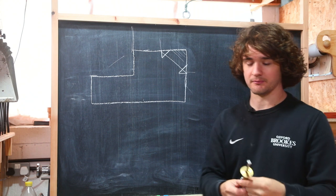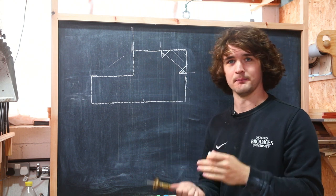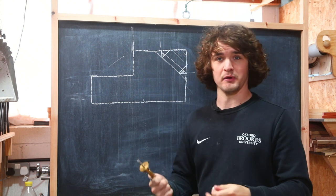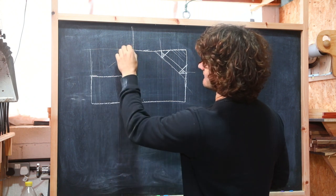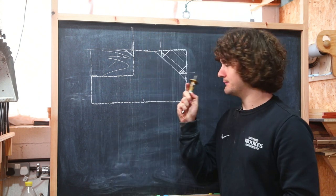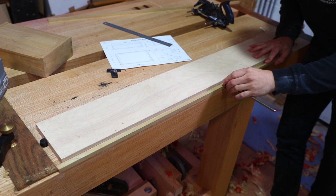Although we want to use a marking gauge to mark this out, just ensure you don't make it too deep. If you really start cutting into it at this point, those areas will leave marks that are difficult to remove — you might have to make the mitre slightly larger than expected, which isn't the end of the world but is completely avoidable. It's okay to cut deep with the marking gauge for the rebate because all that material turns to waste anyway, but the mitre line is different. I'll set the marking gauge to four millimeters — the depth of the chamfer — and very lightly scribe that along the top edge so it's not too deep but still easily visible.